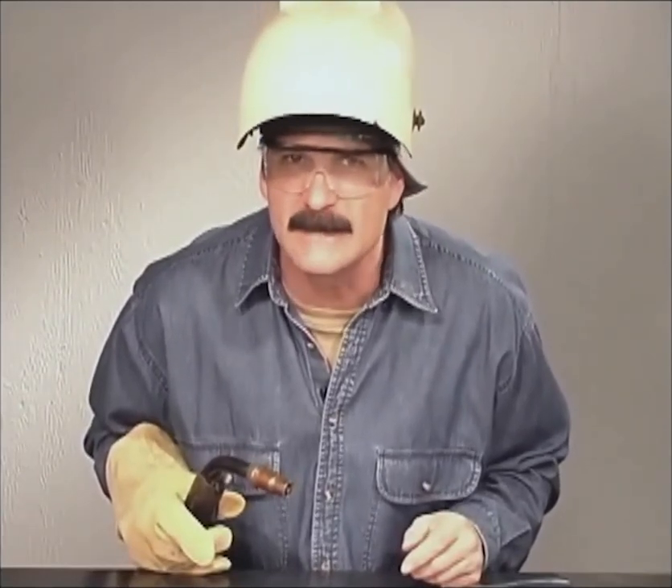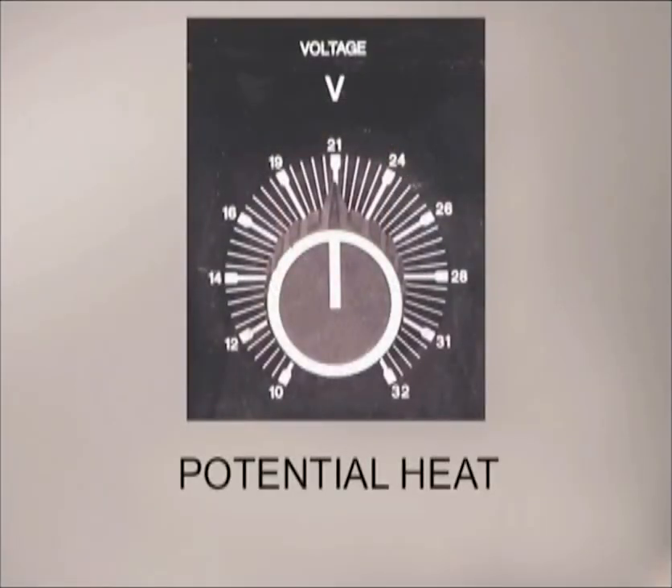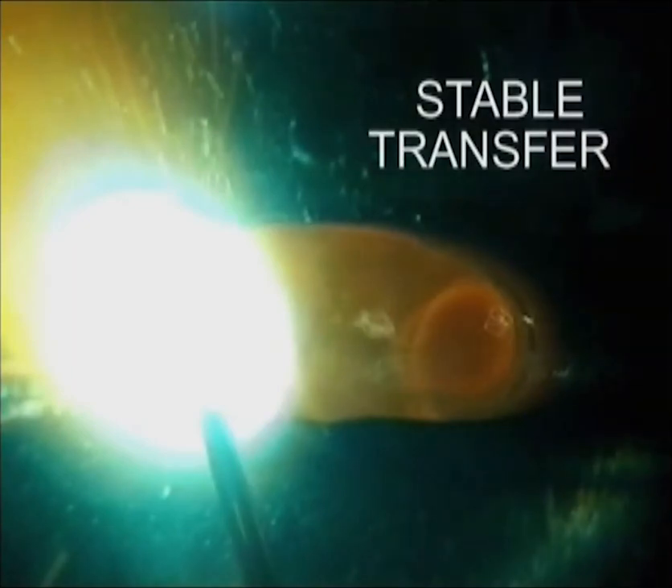One of the most important aspects for making successful welds is the voltage and wire speed settings. Basically, the voltage controls the potential amount of heat available to the weld, and the wire speed determines the amount of weld buildup. The voltage and wire speed are adjusted to provide the amount of heat and weld deposit required for the specific welding situation. Importantly, the voltage and wire speed are always adjusted together to produce a stable transfer of filler metal from the welding wire into the molten puddle. This means that anytime you increase the wire speed for a bigger weld, you also need to increase the voltage. Similarly, if you want a little more heat for better penetration, you can turn up the voltage, but you also need to increase the wire speed, tuning the two together for optimum metal transfer.